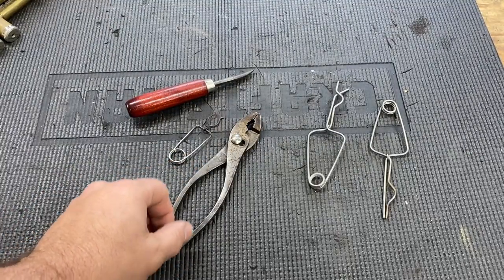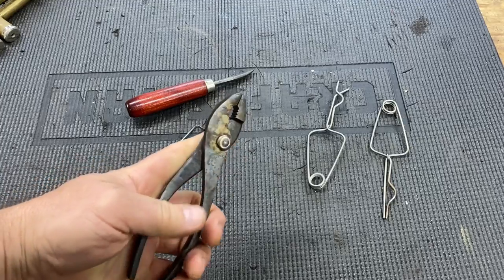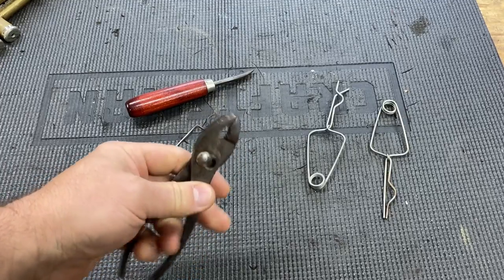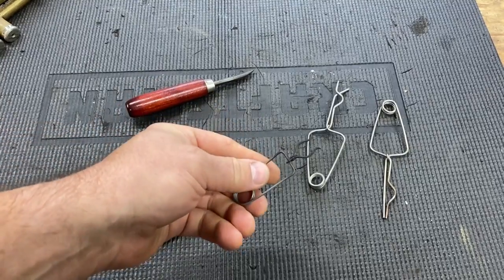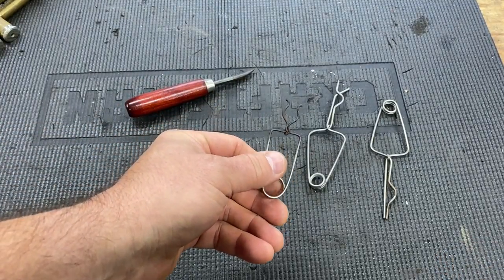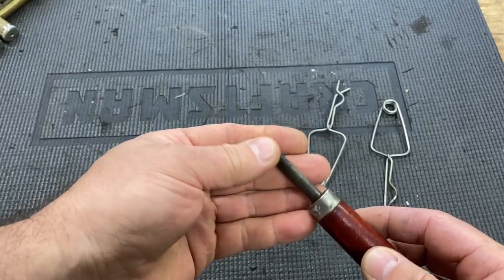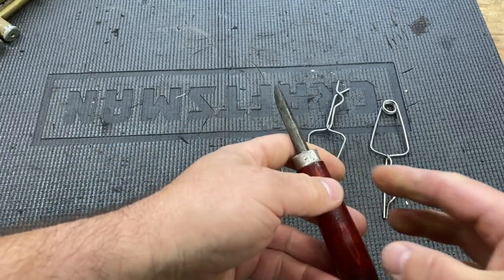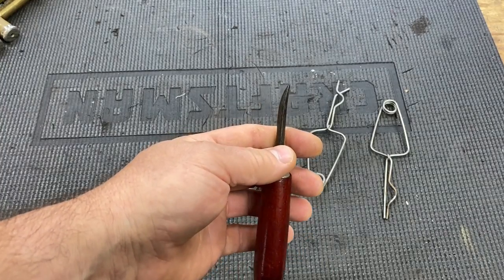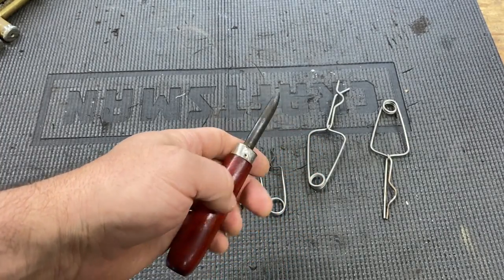Next is fit of the parts. You may have a pair of pliers to bend flanges and rods so that you can make proper fit. Some clips to hold the flanges to the horn, maybe a curved soldering burnisher so that you can lay things down and make them smooth and as tight fit as you can.